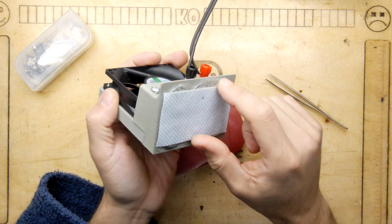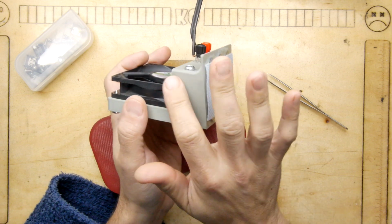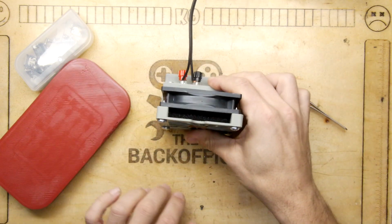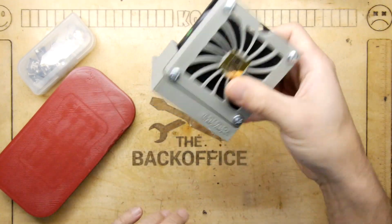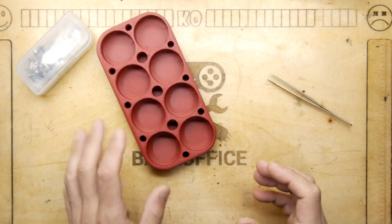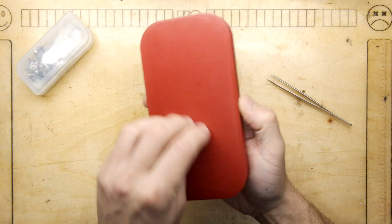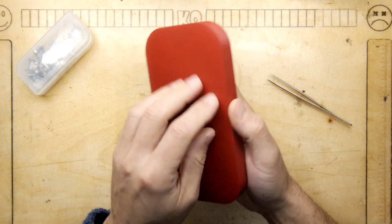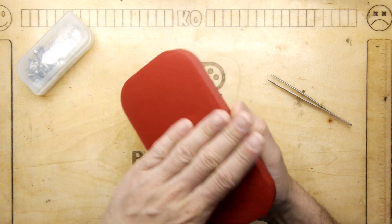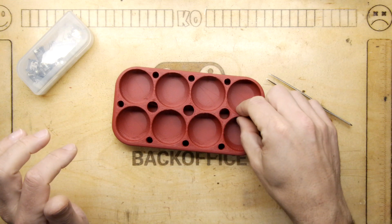So this fan, actually, I've super glued washers on it to give it more weight because it was very top heavy with that fan. But I've put that on there, so that when you put it on there, you can see it moves the board. It's very grippy. Sometimes when you print stuff like this, you can see it is kind of slippery, and it's kind of hard to rough this up because if you try to rub it up too much, it kind of goes a bit weird and furry because you start melting and it's not a good finish. So yeah, you can sometimes just stick some of that on there and you'll give it a nice bit of adhesion.